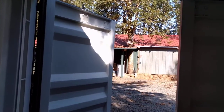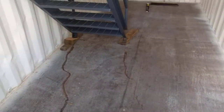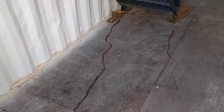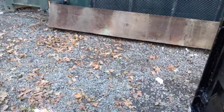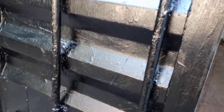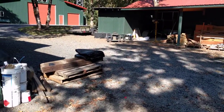Really all I've got to do is lean up the wood against the outside of the unit, seal these doors up with silicone on the inside and the outside, and then put it in the ground. I'm going to treat the floor, but I'll do that after it's in the ground — there's going to be too much going on inside before then, and it's still a little wet from the rains when I had the roof open. I'll put it in the ground, run a dehumidifier in here for a month or so, and then put a coating down on the floor to both weatherproof it and give a nice reflective coat — that'll probably be gray.